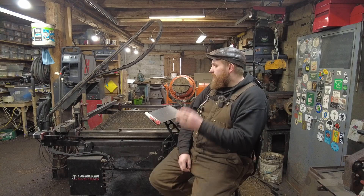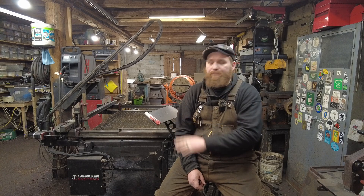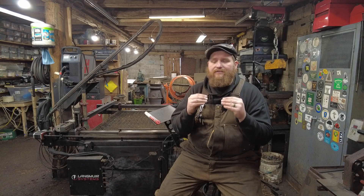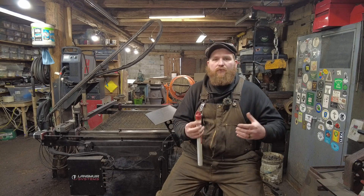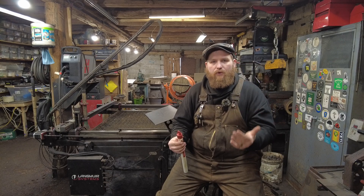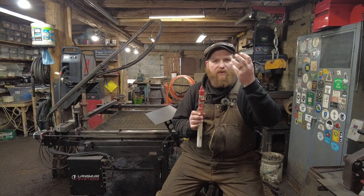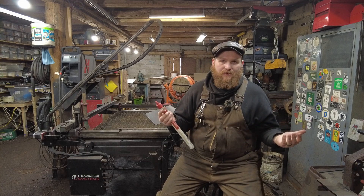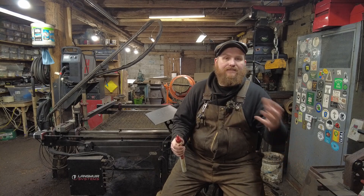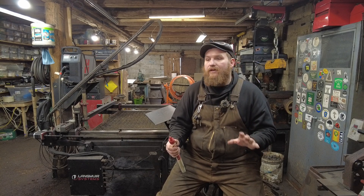This was not for the faint of heart. There are many things I would do differently if I were going to braze this pan together again. I would have clamped it up a lot more with heat sink blocks around where I was brazing. It's a bit different from brazing I've done before — usually the brazing rod wets into the surface and flows through the joint. But this acts more like a TIG rod; it wets into the surface but doesn't flow completely through the joint. It more or less stays on the surface, which took me a little while to figure out, causing excess heat to dump into the thin pan and create some really big heat warps.